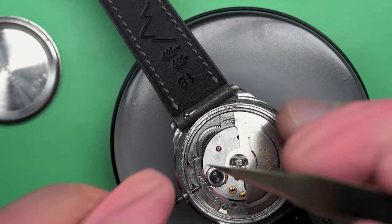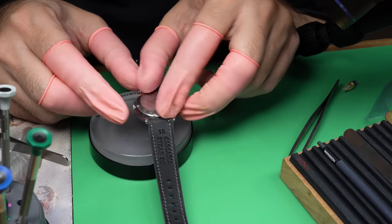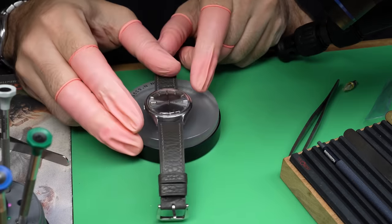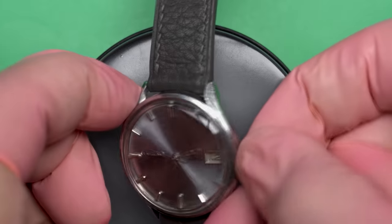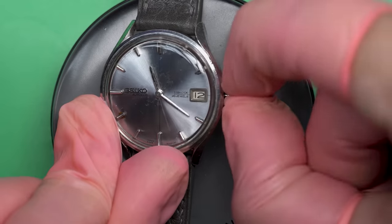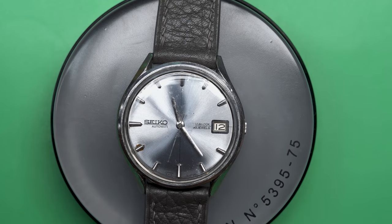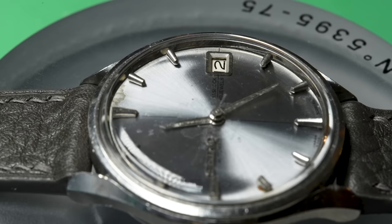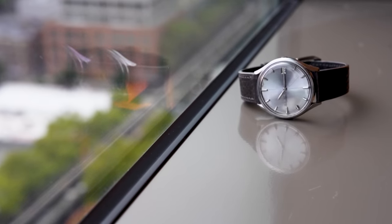I'd like to get this project done and get it into Mikey's hands. That looks much, much better — but that was a test fit, because before we can call it good, I need to use a little bit of Loctite on the threads. This is the softest Loctite — it won't hold it completely, it doesn't freeze it in place or anything, but it will keep the crown from backing off of the stem itself. So now I can replace the back and take a look at what we did — really nice. And this crown is comically small — this watch is very dedicated to being an automatic. The crown is only used to set the time and the date; you can technically wind it, but I don't know how anybody could get their fingers around that little tiny crown. So it's just going to have to sit and you're meant to wear the thing every single day.